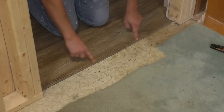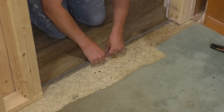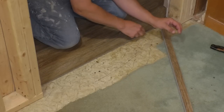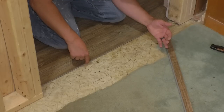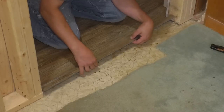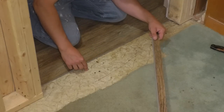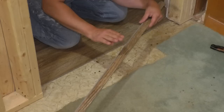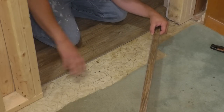I'm going to take this last piece of flooring off and just lift it up. The reason I put it in there was to protect the tongue on this piece of flooring — walking in and out, you can damage it and you'll never be able to get another piece in to lock in. Whether I do this floor continuous throughout the room or do a small piece and transition to a new floor, at least this will be protected. I'll cut it and put it back just to protect the tongue after the door's in.